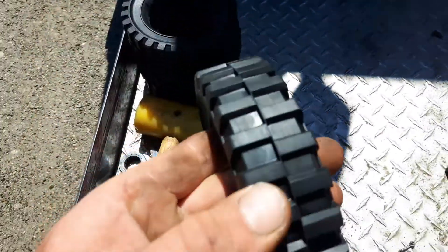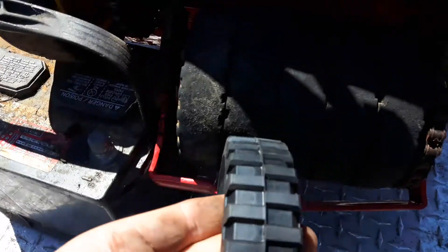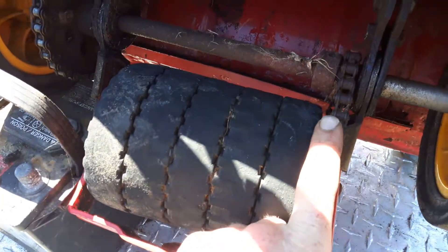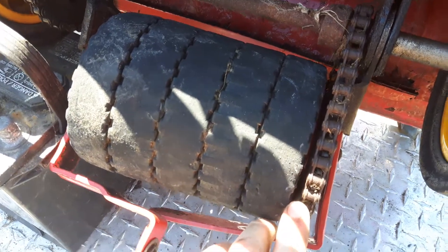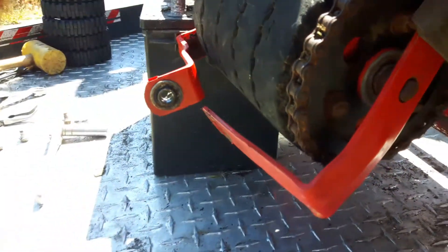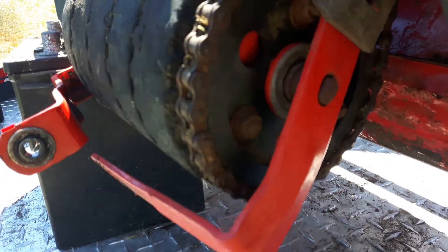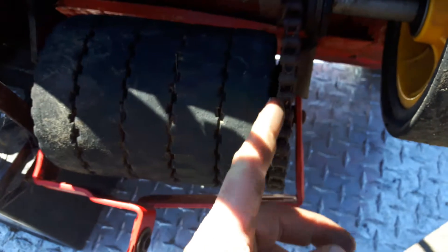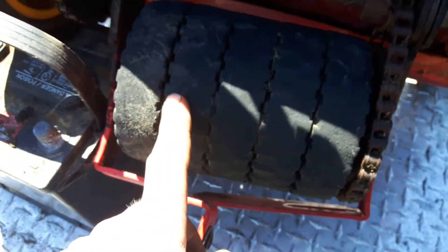Here are the new replacement wheels, and you can see there's tread on them. The reason to change them is because the worn wheel will leave tracks in the lawn. You can see it's not flush yet, but very soon this will drag in your grass and leave a line while you mow, so you have to change these wheels.